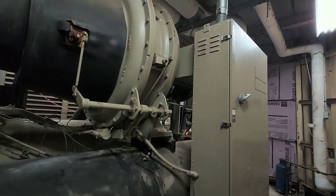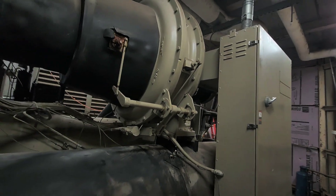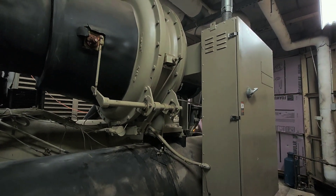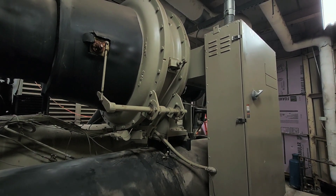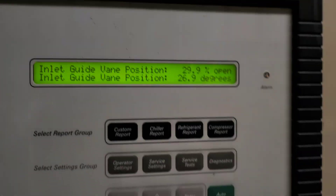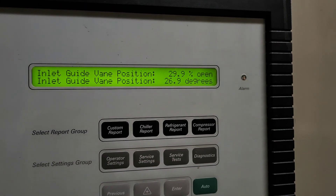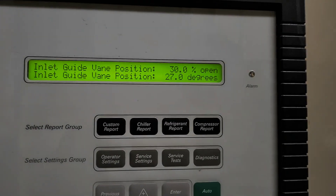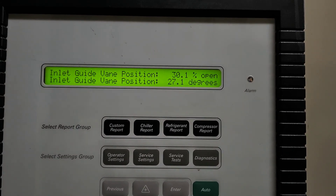That was the Y contactor. Now we're going into the Delta. Kind of doing a hot hold on this thing, so it is a good test to see how she's running. Our condenser water is not very warm today so the chances of surging are quite less.